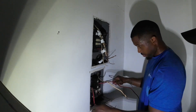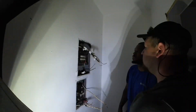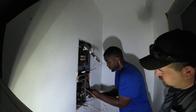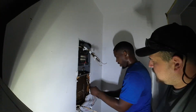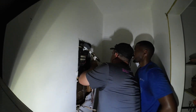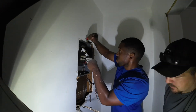Once I finished getting the wires disconnected and taped up, we got the Siemens panel and lined it up to figure out placement. Then we needed to cut some of the sheetrock. My journeyman explained that most of the time studs are going to be 16 inches apart, but sometimes your panel might not be that size, so you use a 2x4 to brace it. That's exactly what we ran into today, and right now I'm cutting the sheetrock where the 2x4 is.